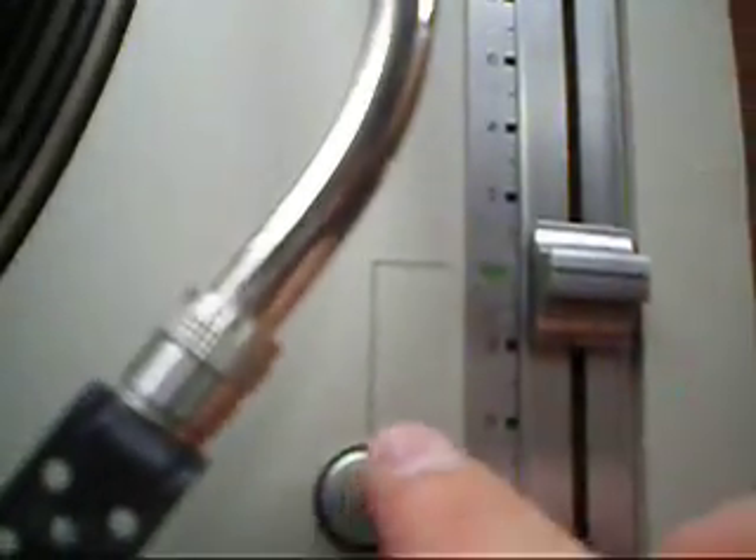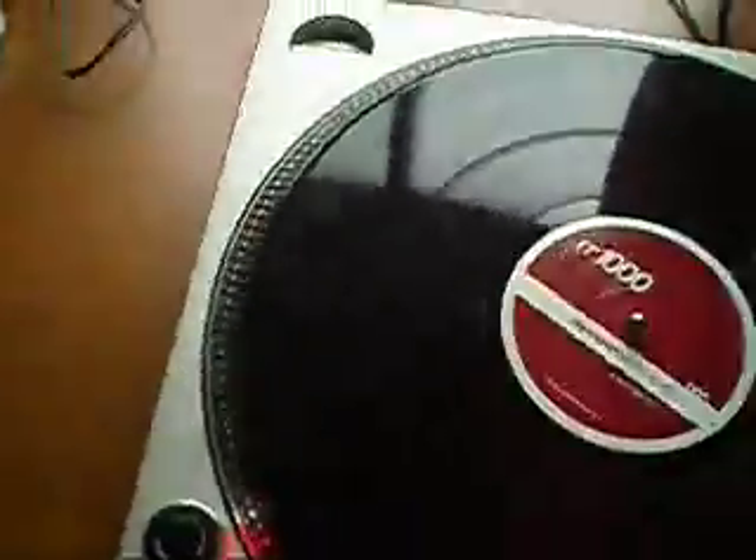The hook lock is working fine, the light for the pitch is working. If you look at the hologram, the dots are not hovering at all — that shows that the motor's good, both on 45 and 33. If I take the record off the platter and come down level, you can see that the platter's not deviating at all. That shows that it's not warped and that the motor's good.